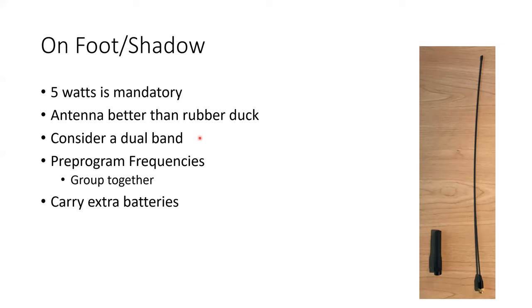Definitely think about a dual-band radio, because you may need to swap frequencies frequently, and dual band can help with that. By dual band I mean one that can operate with an A and B side, both on VHF or both on UHF. Pre-program all your frequencies into the radio ahead of time — say a week or so before. I group them together so it's quick to go from one to the next. If you're using tactical calls, you may refer to a repeater as 'the north repeater' or 'the east repeater,' so set the names in your radio to help with that.